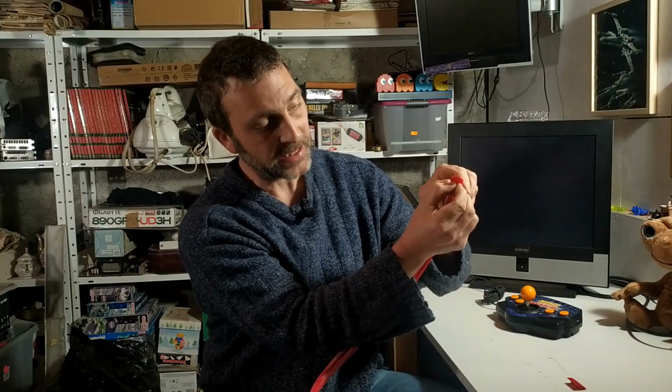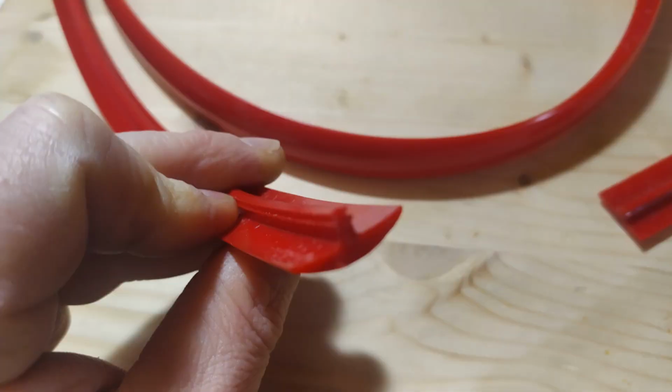But in order to install it, because it's T-molding, it's got a little kind of machined part here that will fit into a groove, or a little groove that is cut in the wood, and it holds in place mechanically. Now, you need to create that groove in the wood yourself in a circumstance like this. And looking on eBay, looking on the web, they all said you need a little router that you can use and easily cut this groove out, and it works great. And I'm sure it does. But even to rent a router costs quite a bit here where I am anyway. So I had to find a different solution.